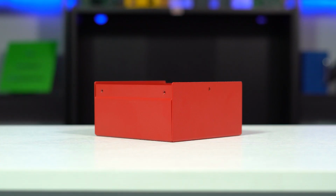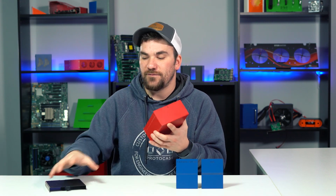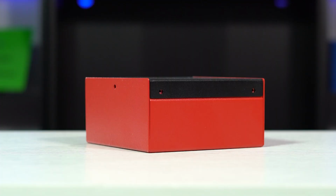These bends can be useful when you're designing maybe an offset base that tucks inside of your lid, or for when you need a little bit more clearance to bypass a certain piece of geometry. So if you take a look at our sample here, the base actually has offsetting flanges that tuck inside the cover and allows the cover to remain flush with the outside of the case. It's important to ensure that you leave enough clearance between the offsetting flanges on your base and the inside of your cover. The typical distance of 10 to 20 thousandths of an inch will work fine.